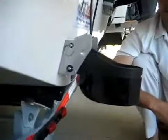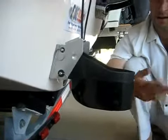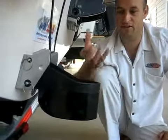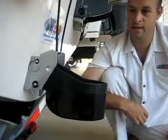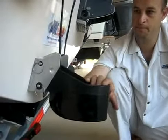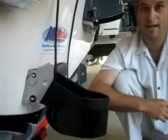We like to keep them angled down a little bit to keep these things in the water at all speeds. The owner is going to take the boat out and sea trial it, and give us feedback on what it's doing. We may have to add one of these wedges, slide the transducer up or down — that's just all part of the process of getting these things dialed in. Anyway, that's the new TM260 from Airmar. I'm Jim from BOE Marine, and if you have any questions about it, just check us out online. Thank you.